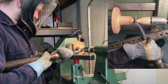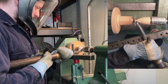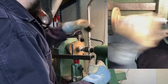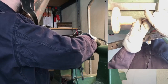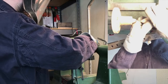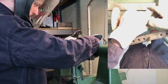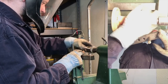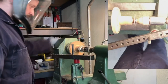I'll spin it just a little bit to get it seated. Now, because pewter doesn't work-harden, it's very easy to thin it while you're working. I'm going to get that seated and then switch the chuck. You want to make sure that you're not putting too much initial pressure on it, and that you have a fair amount of pressure while backspinning or going the other direction. I want to spin this down pretty tightly to the chuck since it has a set form that I want to replicate — I usually do a bunch of these at a time, and that's where a chuck can come in handy for uniformity.